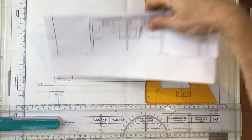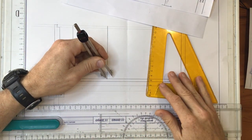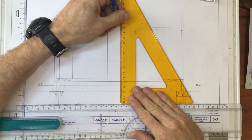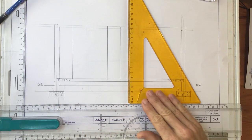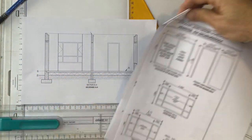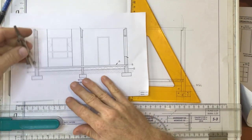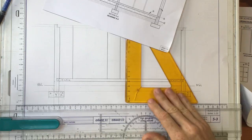There's that little gap in the wall. We need that distance over here now, from there to where the wall is going to be. Take that, place that down, multiply it by two, place that over there, and draw a line going to the top again. I can also draw in the thickness of the wall. Remember we said it's a half brick wall, which is 110 millimeters. That works out to 4.4 millimeters. I can take that measurement and place that over here and draw in that wall.